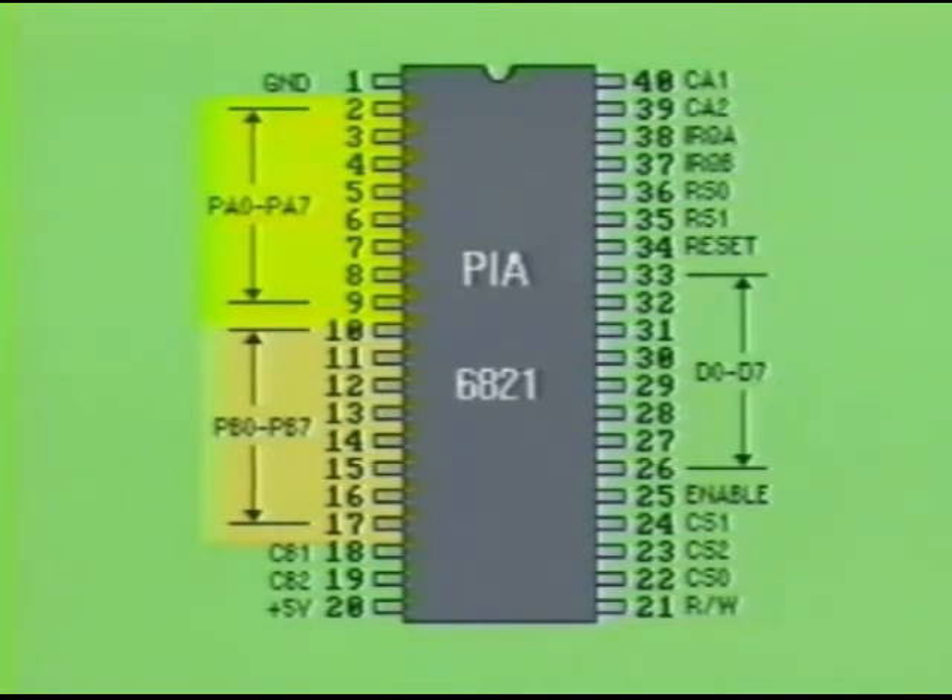The video display has its own I/O device. The IC itself is addressed with 3 bits. These are the chip select pins CS0, CS1, and CS2. When the IC is selected, inputs Chip Select 0 and Chip Select 1 are brought high, while input control pin Chip Select 2 is held low.